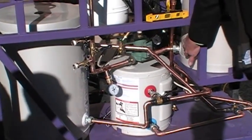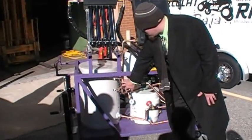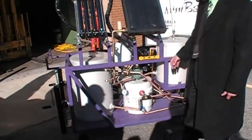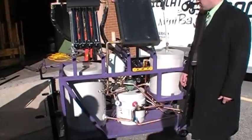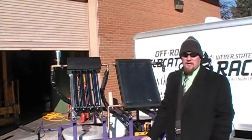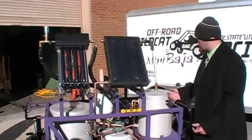Then we have a pump sitting here on top of the hot water heater that's for this system, and that's to circulate the water in the drain back part of it. We had to build a valve, fairly similar to the valve that we were able to purchase, so we could fill the system and get some air pressure in it, because it has to be between 10 and 15 PSI to run right. The biggest problems we had were leaks. The fittings that came with it just would not stop leaking, so we ended up cutting everything off. I had to tear down the whole manifold part and solder on some fittings that wouldn't leak. Everything's working pretty good there.